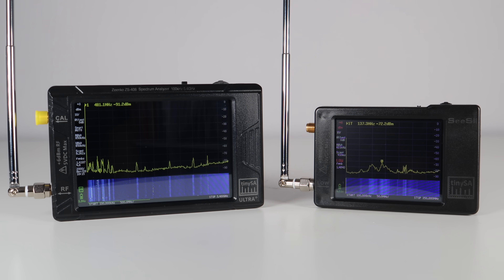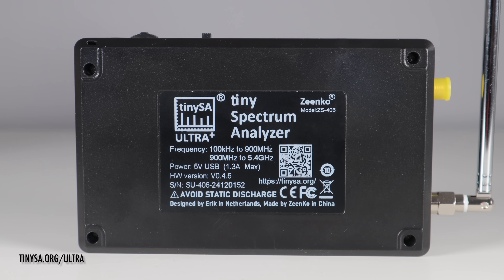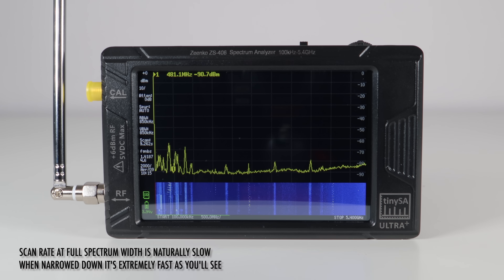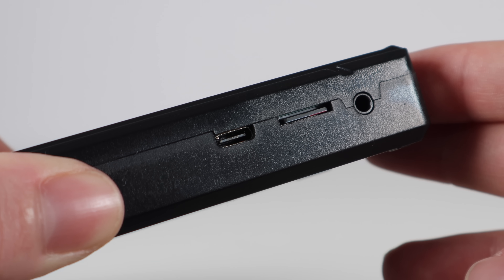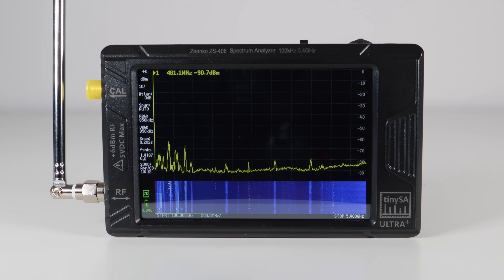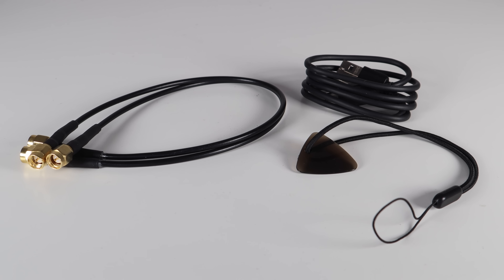If you want to pick one of these up, I'll leave a link in the description below to where I got mine. Very quickly, this has a 4 inch IPS TFT LCD screen and has a frequency range of 100kHz to 5.4GHz, and if you visit the website on screen you can unlock it even further to view a huge chunk of spectrum. What's also handy is the ability to save screen captures to the microSD card, but it doesn't save the waterfall view, which is a bit annoying. It has audio out so you can actually hear what you're listening to. It has a built-in lithium polymer 3.7V 5000mAh battery and supports USB-C charging. The internal LNA gain boosts signals up to 20dB for enhanced signal clarity, and it comes with a little antenna, some SMA pigtails for connecting other antennas, and a stylus for navigating the menus.